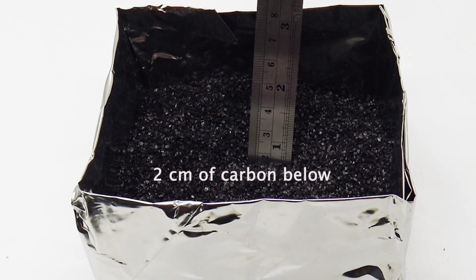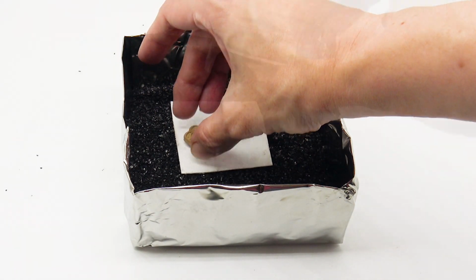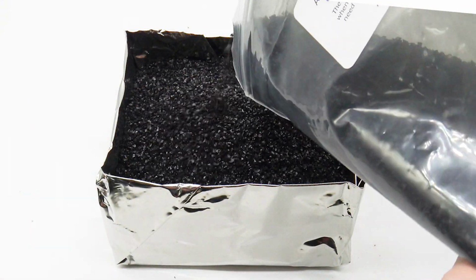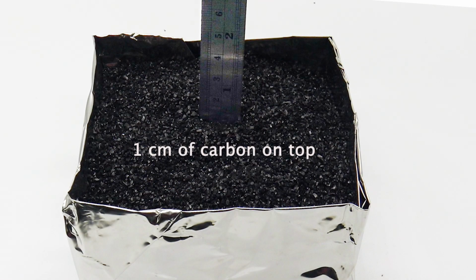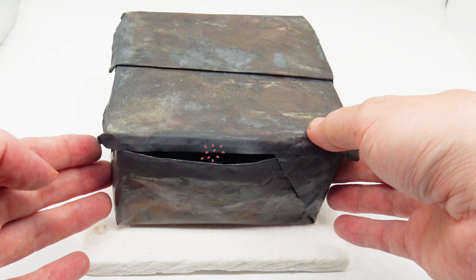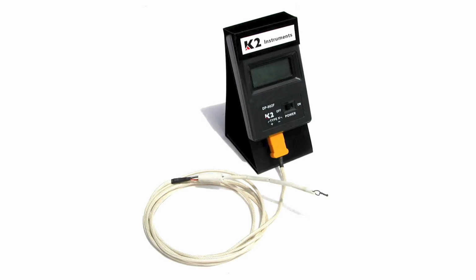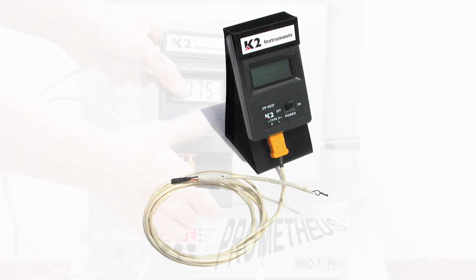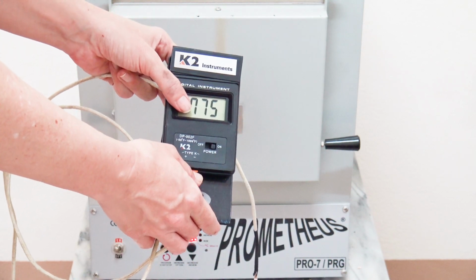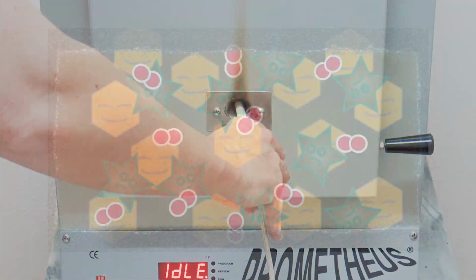Don't put too many pieces in the kiln at one time while firing. You want enough room for the oxygen to circulate freely. Also, leave the firing vessel lid open or completely ajar so more oxygen can enter into the vessel. Also, leave the kiln vented for the same reason. And I highly recommend using an external pyrometer to monitor the temperature of your kiln. Feed the pyrometer inside the kiln and monitor the temperature as you fire.